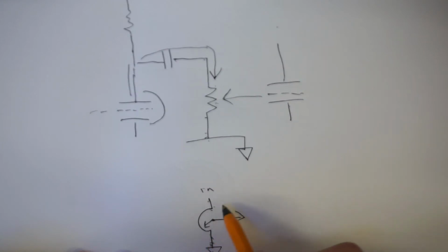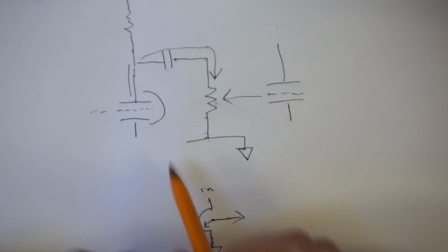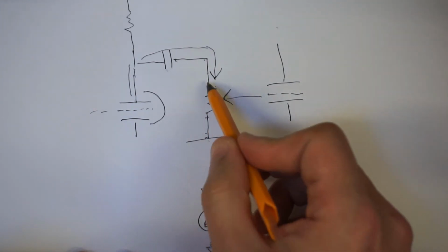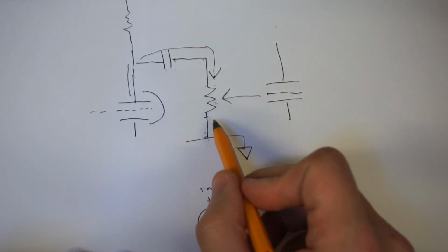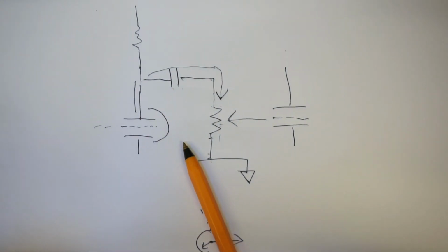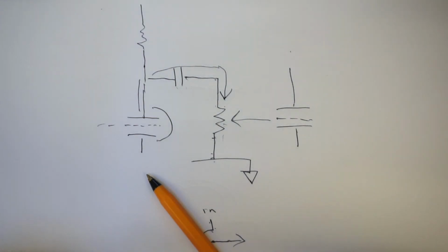That is what varies in resistance. So as far as this coupling capacitor is concerned, the value for the whole of this pot from start to finish stays the same. That is what sets the cutoff frequency, and that's why it actually stays the same in our amplifier. I hope that clears a few things up. I still haven't really determined why we have that sudden onset of bass in the amplifier.